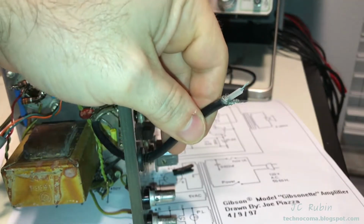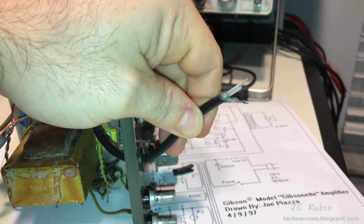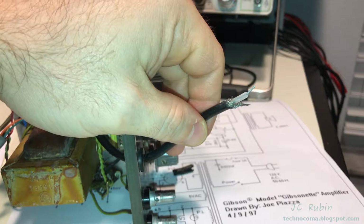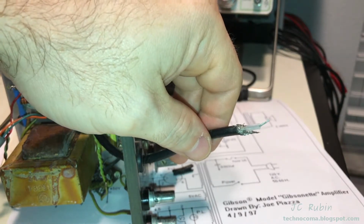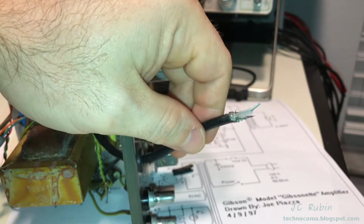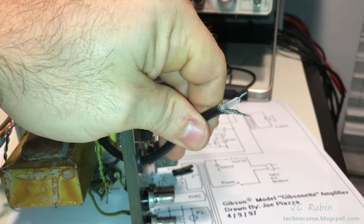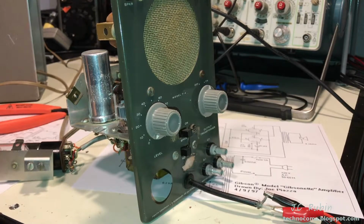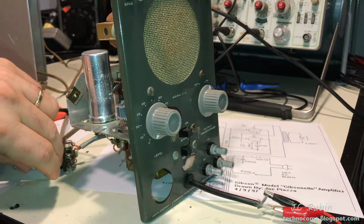I thought to myself, since I've cut the noise circuit and there's no danger of injecting 114 volts, maybe we could just fire this up right quick and see how the beam power tube performs without that 114 volts. If it doesn't work, I'll just re-add it, no problem at all. So let's see what we get as it warms up.